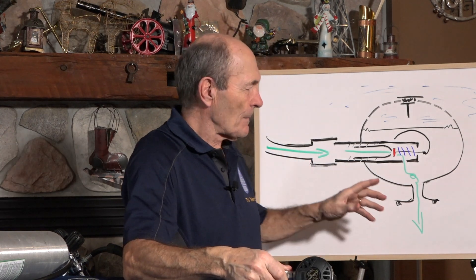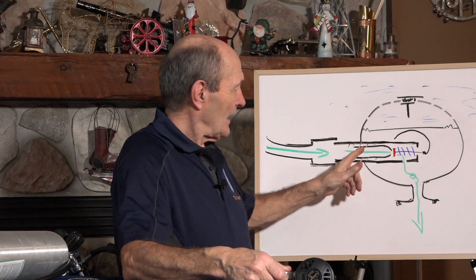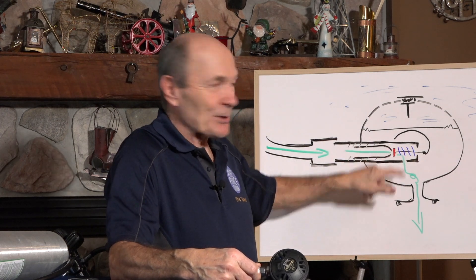Free flow. Okay. So what that means is this cone is not pushed hard enough against the seat. So that's the cone right there — just hold onto it and turn it in. To understand what I just did: this threaded cone that goes against the seat to stop the airflow extends right outside, and that's what I'm hanging on to out here. So if I push the cone in, it increases the pressure on that spring and stops the airflow. If I turn the cone out, it free flows. Turn it in, it stops. Out, it free flows. In, it stops.